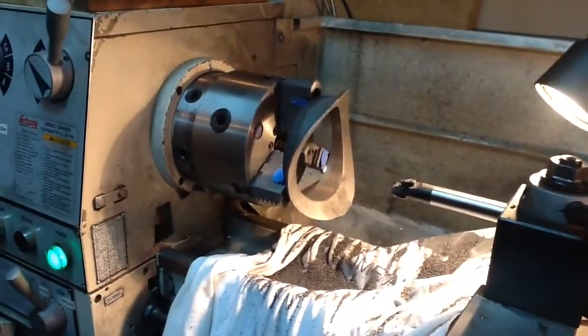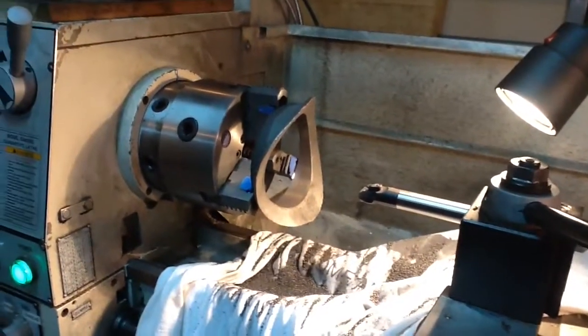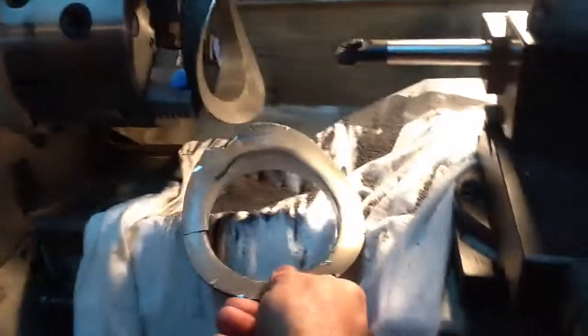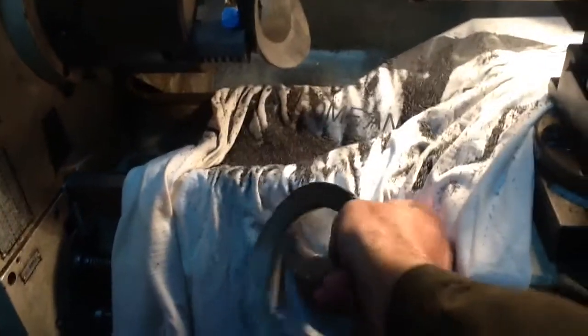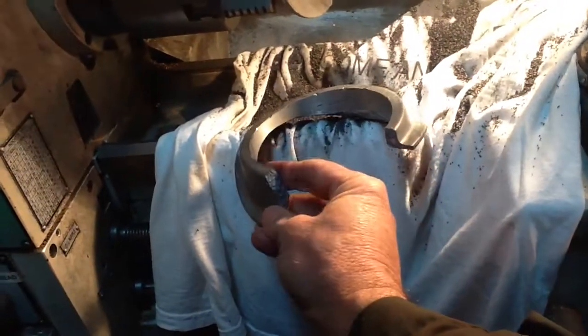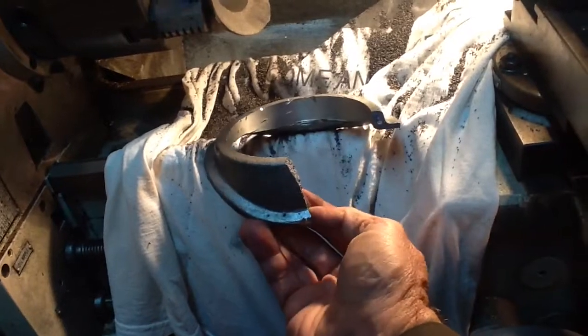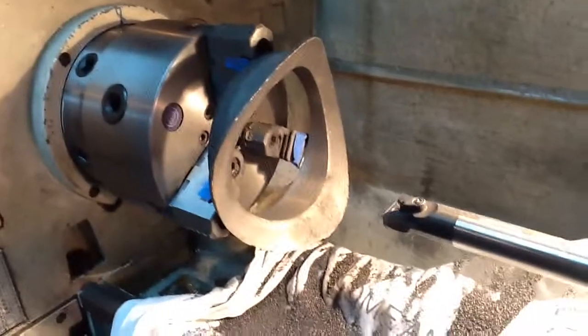Those of you that are regular watchers may recall that I had an aluminum one, which came with the original casting set that I bought. I had it clamped in the mill vise, but it wasn't properly clamped down and I ended up ruining it. I was using a boring bar with a big boring head on a 4-inch hole — it was getting a great finish on the aluminum one, but something caught, ripped out, made a horrendous noise, and shattered the aluminum casting. Terrible result there. Very thrilled that the cast iron one came out so nicely.